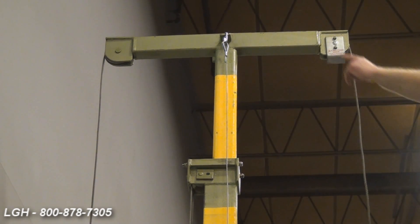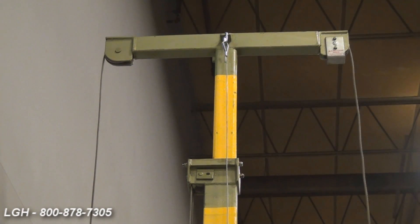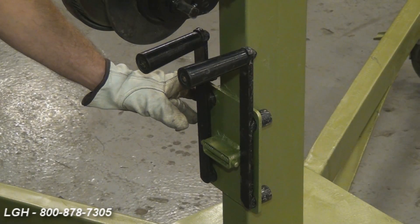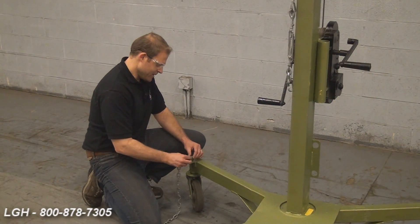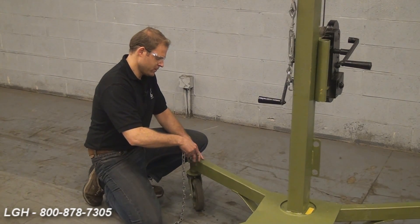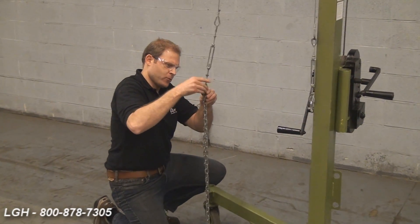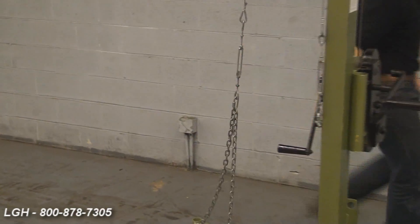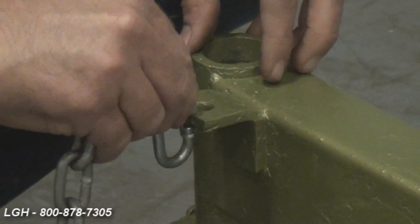In addition to that, there are shear pins affixed to this pulley block. They're a safety feature and designed to fail if you overload the hoist. Located on the mast are handles that control the winch assembly. Now we're going to establish a connection to the rear base plate using our rapid link that is connected to our corners chain.